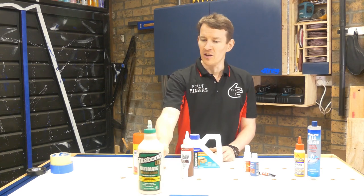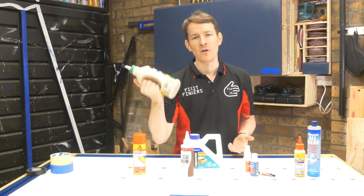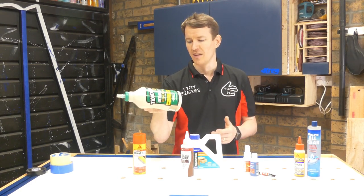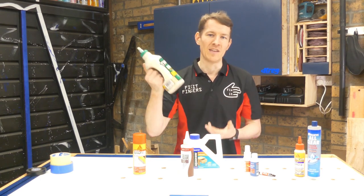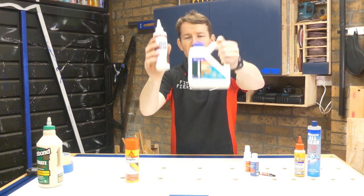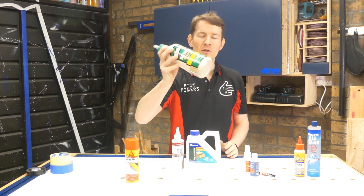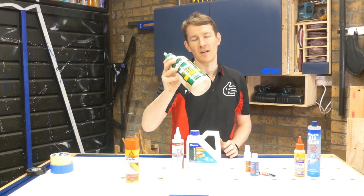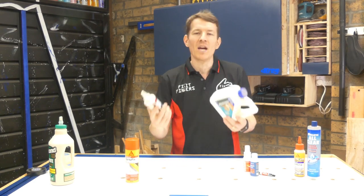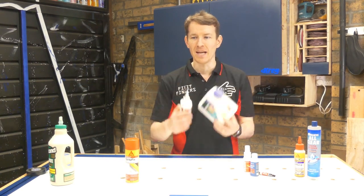Titebond is the YouTuber favorite and very common among American woodworkers — Titebond, Titebond 2, Titebond 3, Titebond Original, all the different Titebonds. Good stuff. Not the cheapest, but fairly commonly available now and it'll get you through the vast majority of your woodworking jobs. It's a bit of a meme but it's the industry standard — it's a good product, don't be afraid of using it. In your big box store you'll get various grades of standard white PVA. The added resins in the yellow wood glue, especially on hardwoods, does tend to work a little better. But the runny PVAs are a lot cheaper and will do the vast majority of your woodworking needs. Either way, a PVA-based glue is your glue staple.